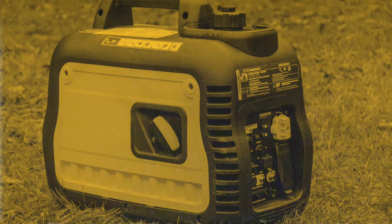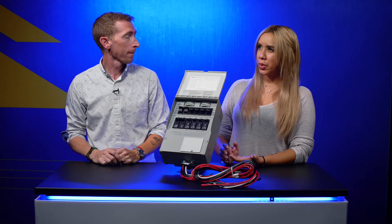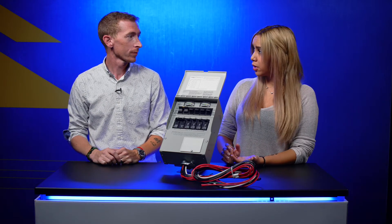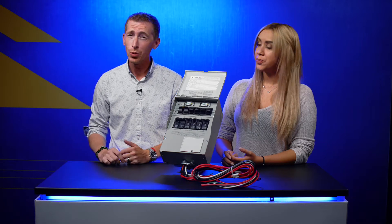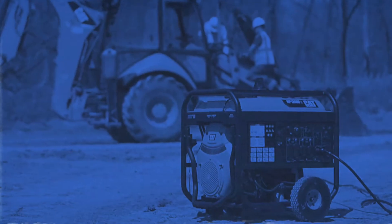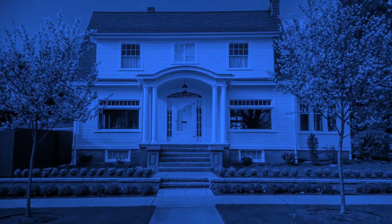Check out this picture of a portable generator. They're handy little machines that homeowners buy for when they lose power. Isn't it true that generators were never actually designed for home backup power? That's exactly right. Most generators were designed to provide power to construction sites, outdoor applications — places where utility power is typically not present. And with 7500 watts of power, what people don't realize is that most don't even use that much when backing up their home.